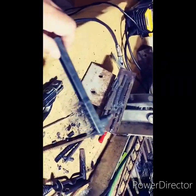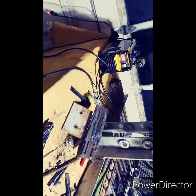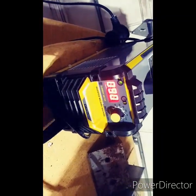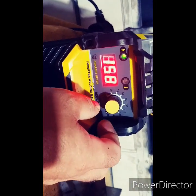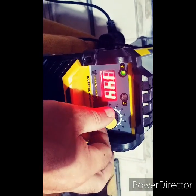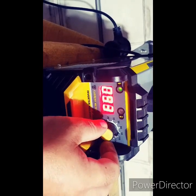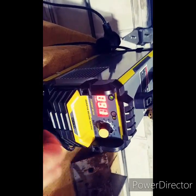I'm really impressed for the money and the weight — there isn't anything cheesy or corny about the meat and potatoes of it. There is a wire brush that came with the kit, which is probably the only cheesy thing, but for $128 you absolutely cannot beat this. You can see the amperage here — we can crank this bad boy up. It tops out at about 158 amps. I had it at about 130-140 at the start and was just really slopping it up, so you don't need it that hot. I'd imagine you probably couldn't run as long at that amperage on 110 either.